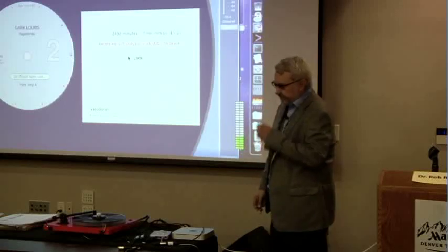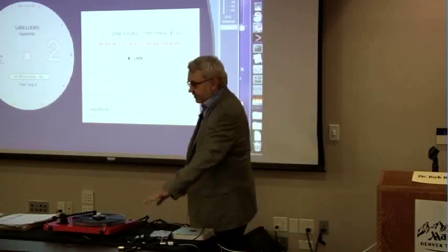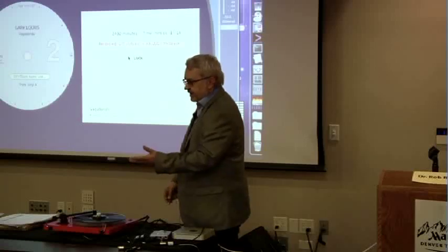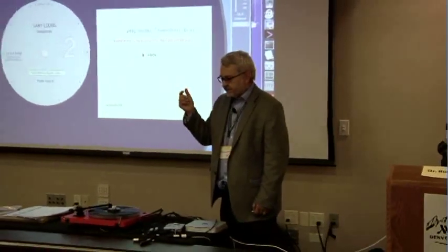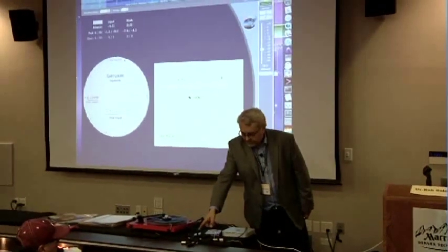Yeah, we make adapters for moving coil and moving magnet cartridges. You specify the load, or if you don't know, we'll look it up for you. And the moving magnet also includes a built-in load capacitor, which is part of the cartridge load that you require. Okay, so that's the only other hurdle here, and it's a really minor one. So these adapters are your name? That's right. It doesn't come with the order? No, it doesn't. How much are those? We have a $40 discount if you get a license to our software, $35 a pair for these type of adapters.